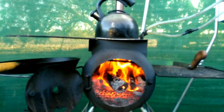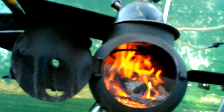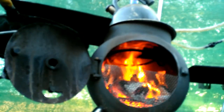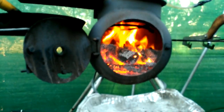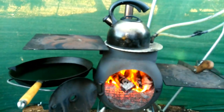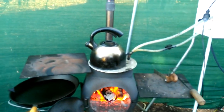If you look down there in the firebox, you'll see the copper coil on top. You can put more windings in — I've just tried it with that — but it tends to boil the water if I have too long a length of copper pipe. That one works fine. It's important that it fits inside the actual hot water box when you're finished, so it fits in your jerry can holder. We don't have much space and when we go camping, every little bit of space is used.